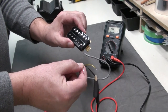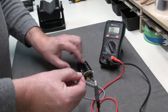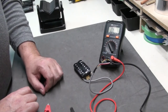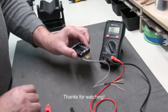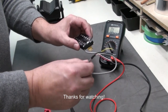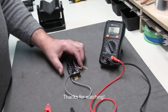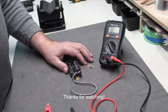It doesn't mean the output is going to be lower than a single coil on the Strat we just looked at, but it's just letting you know that it is splitting correctly and everything should be working fine. I hope that helps — just a quick tutorial on using a multimeter to check the resistance of your pickups, whether they're out of the box or already installed in a guitar or bass, and a quick tip on using the multimeter to measure continuity and check any ground issues. Thanks for watching — we'll see you in the next video. Bye for now.